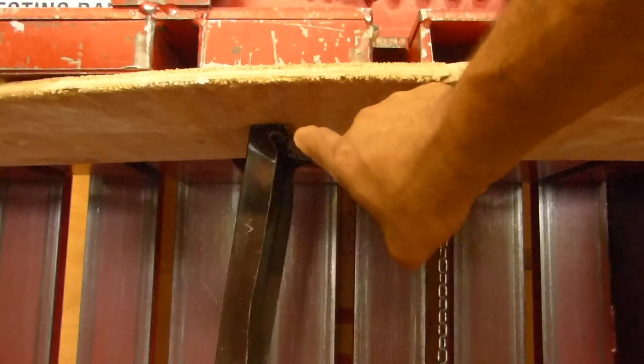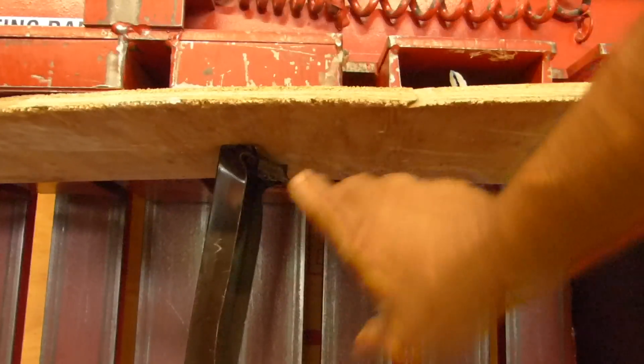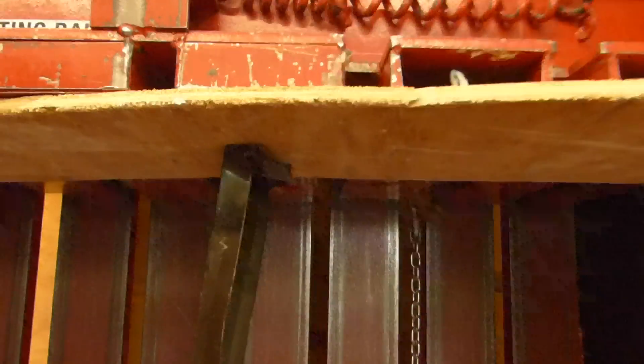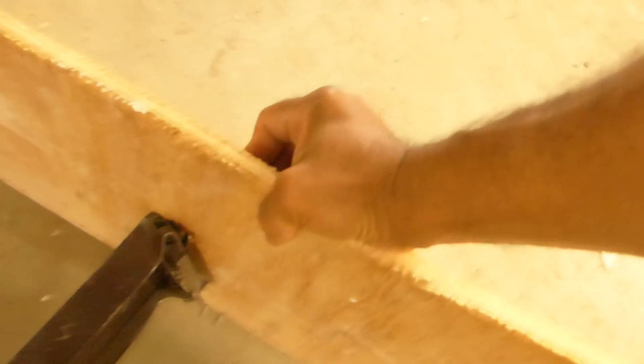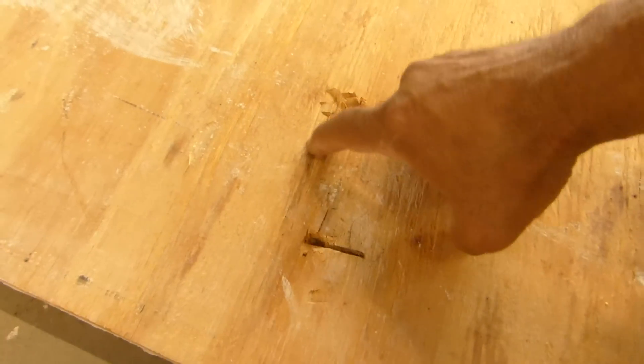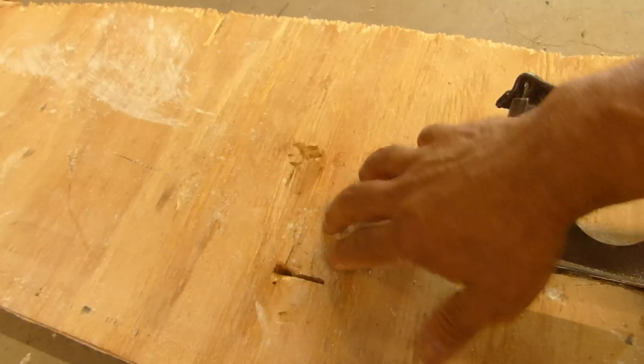It's going to transfer one to one into the plywood almost and into the steel. So let's pull it out and observe the punching shear that it put inside. See the top of it? It's undisturbed pretty much. But the underside — you'll see that it started punching through it. If I didn't have it at that other piece, we would see it go all the way through.